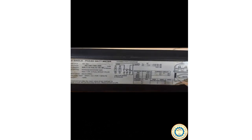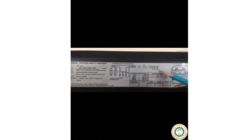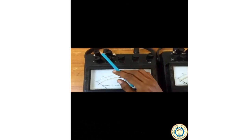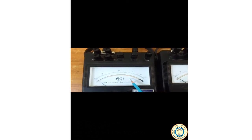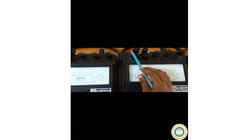If I need a current rating of 10 amperes, I need to join terminals B1, E2 and E1, B2. If I need 5 amperes, I need to join B1 and B2. In this particular wattmeter, the connections are B1 to B2; E1 and E2 are not connected. So the wattmeter is connected for a range of 5 amperes. Similarly, wattmeter 2 is also connected for a range of 5 amperes.